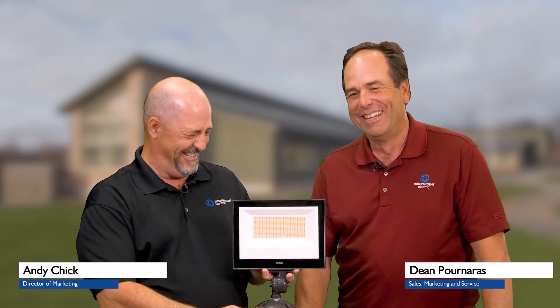There is another unique thing though — it's also dual voltage. Some floodlights are 120 volt and some are 277, so you're getting dual voltage. And there's one other feature that's really nice — 0 to 10 volt dimming. If you want to dim the fixture, it has purple and gray leads out of the device and you can hook it up to any control system to get dimming out of the product as well. All under that ultra economy umbrella price.